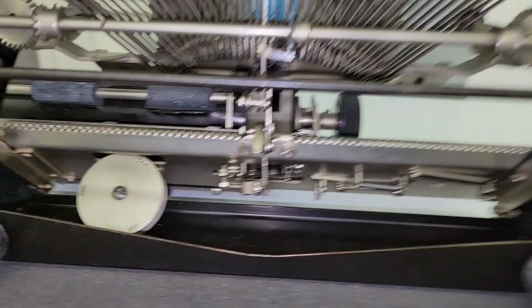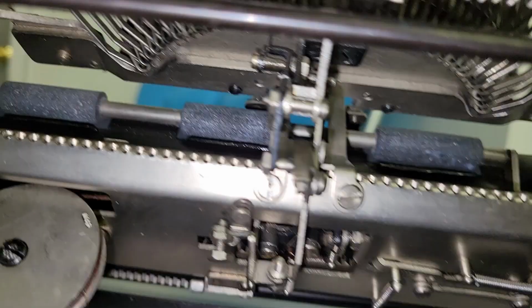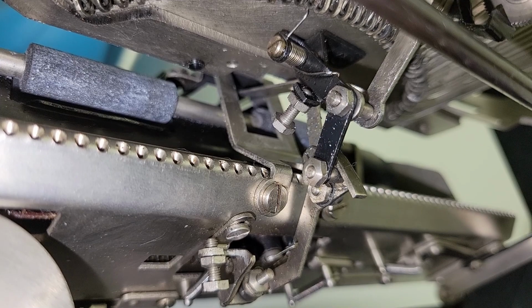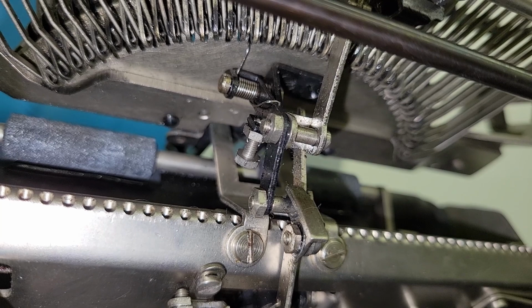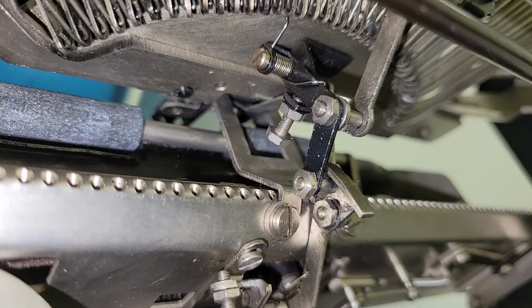Now for the actual escapement. It's rather hard to see on this machine, but you can see there's that link. So yeah, it's pulling there in a class 3 fashion. I'd call this a class 3 bell crank. So, okay. I'm not sure if this bolt here is eccentric and whether or not that can be used for escapement trip adjustment. But regardless, it pushes on that surface. As you can see here, depending on the shifted state, it will still be able to engage.